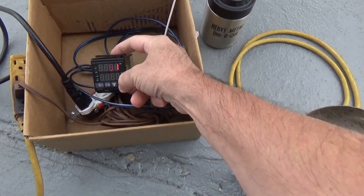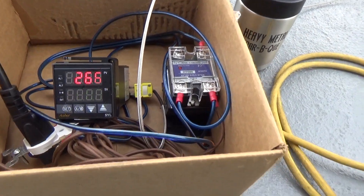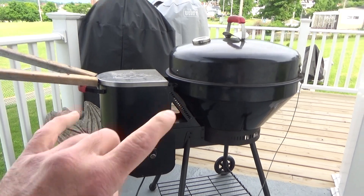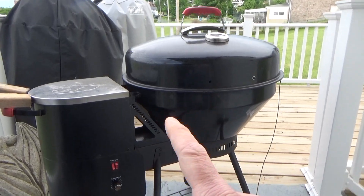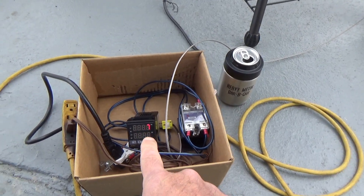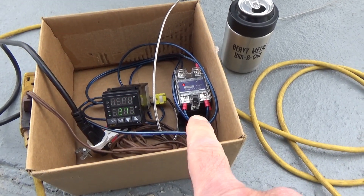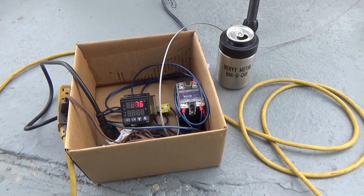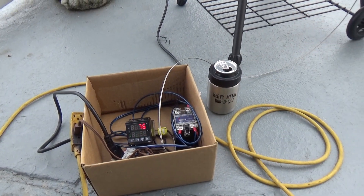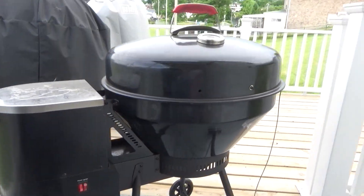This PID is smart - look at it, it won't overshoot. It'll just slowly work its way up to that set temp of 275. Look at that - is that cool or what? So here we are after 15 minutes with the PID controller set at 275. The pit temp never went above 278 and never went below 274. It is maintaining temp within a couple degrees - plus or minus - it's just amazing. Let's take it up to 300 now.